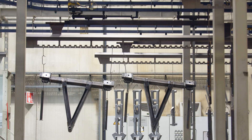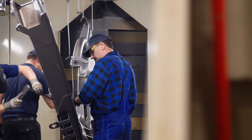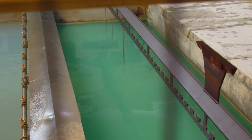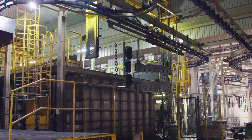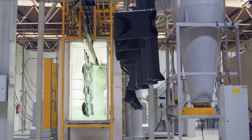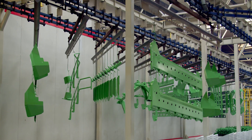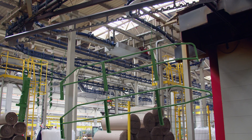Already welded parts are sent to an automatic painting line where they first undergo mechanical and chemical surface preparation before painting. The details are shot blasted, washed, degreased and phosphated in process baths. Then a cataphoretic coating is applied ensuring very high anti-corrosion protection for the details. The same method is used in the automotive industry. Top coat application is done in an automatic paint booth with quick color change feature, and then the components are cured in a tunnel oven. The use of facade-type polyester powder coating ensures high mechanical and UV resistance properties.